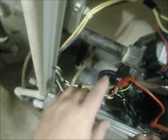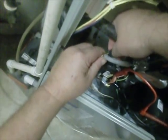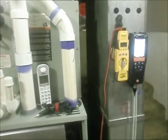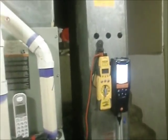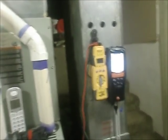We're going to remove the reference tube, which joins into the gas valve and the burner box — just pop that loose right here. Then we'll take our vacuum hose, put it directly on top of the pressure switch, and take this brass tee and hook it directly back into the reference tubing. Just look it over to make sure there are no kinks. Now, the first test will incorporate the FieldPiece HS35 — I've been using FieldPiece for many years and think it's a fantastic product that really brings its game to the HVAC industry.